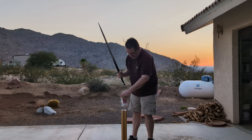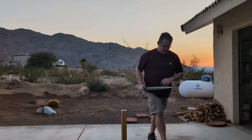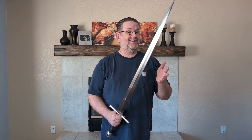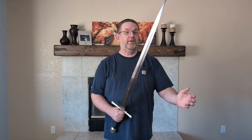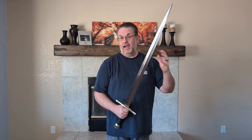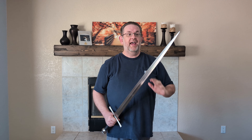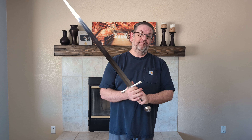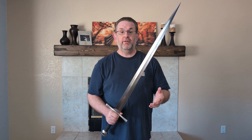Taking a look at the blade with some basic measurements: it is a little under 32 inches long, the sword weighs in at 2 pounds 12.5 ounces, and the point of balance looks to be about 2.5 to 3 inches from the guard. For distal taper, it starts at 6mm thick at the cross guard; about halfway up it's only tapered about half a millimeter; up near the tip it's down to about 4mm; and right at the tip it's around 3.5mm. That's not a lot of distal taper, though it gets away with it due to the shorter blade. It could really benefit from starting more like 7 to 7.5mm and tapering more complexly, but it's effective for what it is — just not particularly refined.